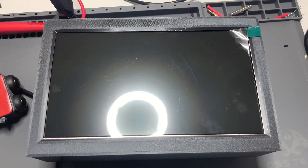This is a 1mm thick PETG screen, which I use as the waterproof covering for the display. These get masked and sprayed to the exact size of the display, which is the 7-inch display inside the TFT dash. Let's get this marked up, masked, and sprayed. That takes about 24 hours to dry, and then we'll have screens ready for the final assembly.